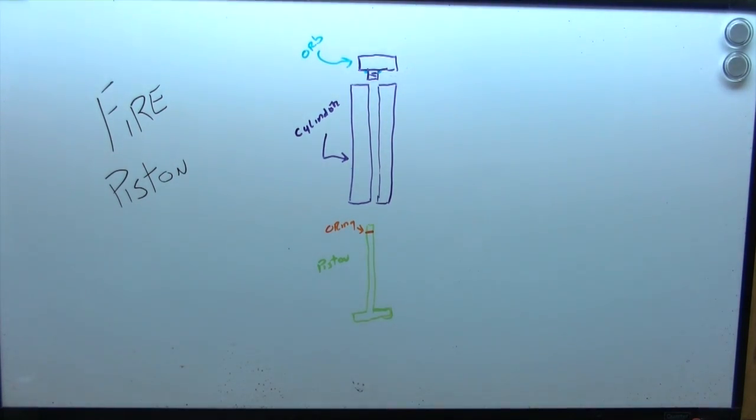In this video we're going to attempt to make a fire piston. We need to drill out the center, and on top we're going to have an ORB fitting — I'm using that because it has a seal, since we need compression inside. The piston we're going to machine will have an o-ring as well. Basically, if you're out hiking or camping and your matches are wet, you put some char cloth on the top of the piston, slam it down on the ground, and the compression will be enough to ignite the char cloth and hopefully get a fire started.